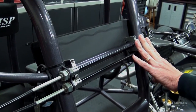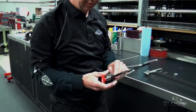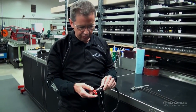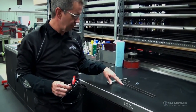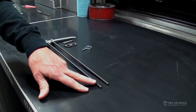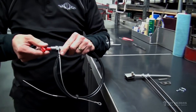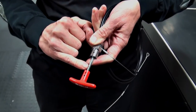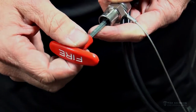This is all very easy installation. Now I want to show you how to work with these cables. This is the cable that comes with the fire bottles — depending on the manufacturer it could have a different type of handle or look slightly different. It's attached the same way the rod ends are, so you will have to drill and tap — you'll cut some 10-32 threads in the ends of these tubes. To prepare the cable end, pull the handle out — there's a little roll pin in here. You can knock that roll pin out, then take an abrasive cutter and cut this off and pull it out of the way.